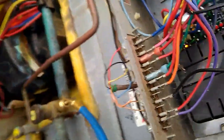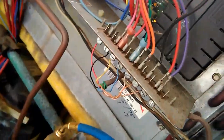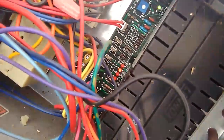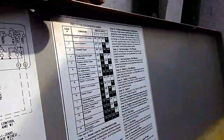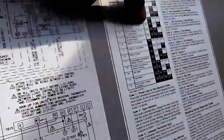Right away I see the contactor is not engaged. We've got diagnostic codes on the control board here — one is actually constantly lit: it's the number four code. Certain boards have these diagnostic codes and you can identify the code to figure out what's going on. Looking at the diagnostic code chart, number four means 'pressure switch open.'